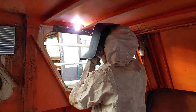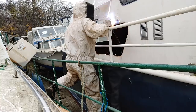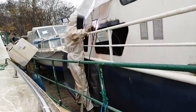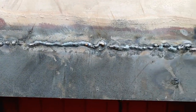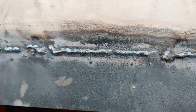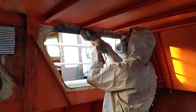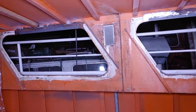After first making some welding points to fix the part in place, I could then proceed to fill in the gaps — the same on the outside. I'm happy to announce that I made some progress in my welding skills. While I consider myself to be still at amateur level, I feel much more confident about these welds — some of them are actually not too bad. I then ground away the excess material to make the surface flat again.